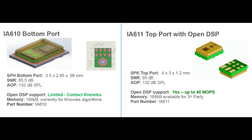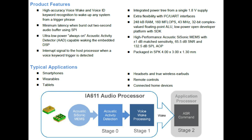Looking at the CAD image, the two green dots in the middle are the MEMS microphone elements — dual mic elements. Then there's a wire-bonded chip, which is the DSP chip. You can program it with a voice wake word model. It comes with a couple of models already, or you can program your own and download it into the firmware, and it will constantly listen and do your wake word detection.